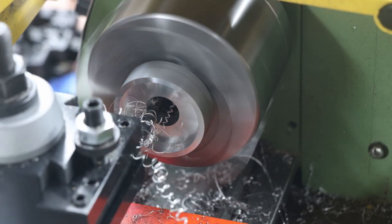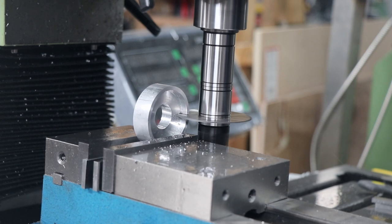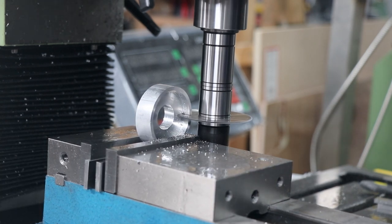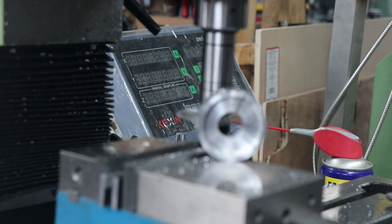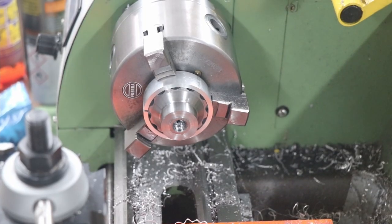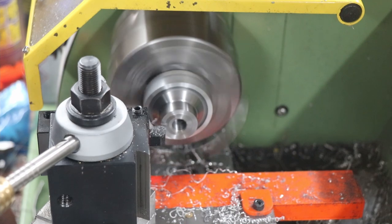Here I'm just making a quick clamping ring for the handle to surface the back of it. And the purchase list goes up to three, four - the slitting saw, also newly acquired for this project, mostly just to do this. I've used it for a bunch of things since, but it's quite useful. I probably should have cleaned more material out in the middle of this; it was very difficult to clamp it down hard enough and I kept kicking the handle out. I think I edited all of that out so it looks like this worked perfectly first time.